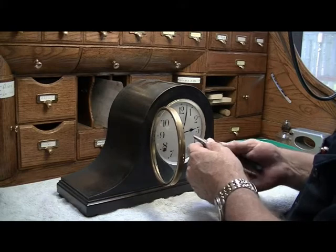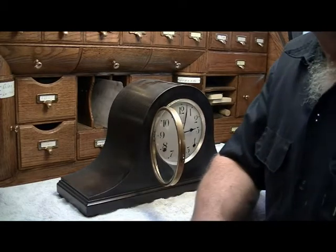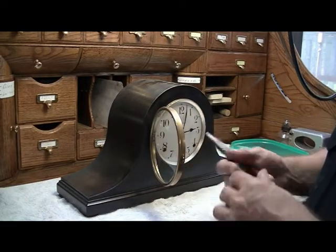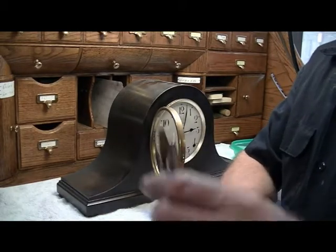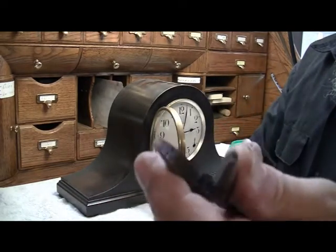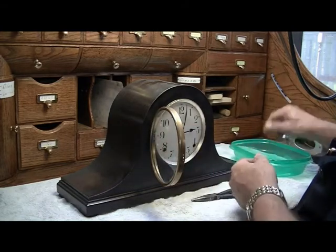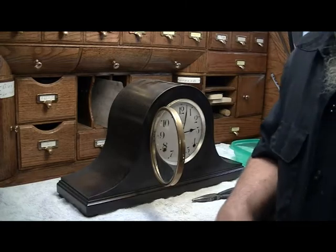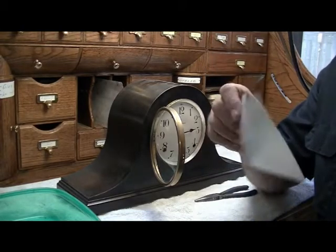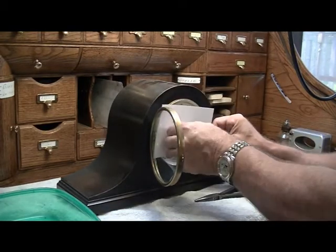First thing you've got to do is take the hands. I'm going to show you, for you hobbyists and aspiring horologists out there, some of the tools I use — some of which I've made. This is how I remove and install taper pins. I took a pair of needle nose pliers and if you look real close, there's a slot on one side and not on the other, and they've been blunted down. This is how I safely remove taper pins on these clocks. This is just a regular piece of photo paper — a heavy type paper with a V cut in it. You put it down like this so you can do work on the hands without getting the paper dial messed up.